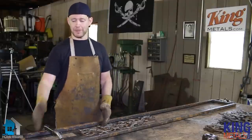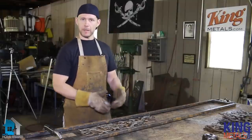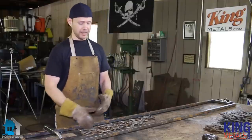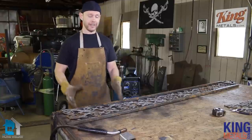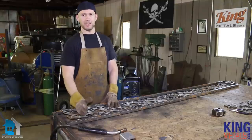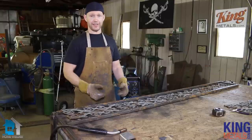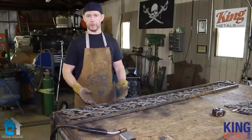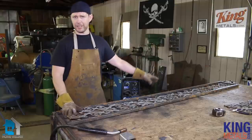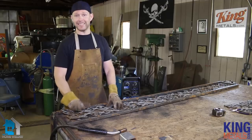I personally like having the cut pieces at the bottom. I'm going to start from the top and work my way down, and lay these in just to make sure they fit within my frame. Before I do any cutting, I'm going to go ahead and weld this up first — I don't want to cut these before I weld the whole panel together, because in the process of welding there could be a small gap that makes it a little longer or shorter. I want to weld it as one piece and then cut it so I know it's an exact fit.